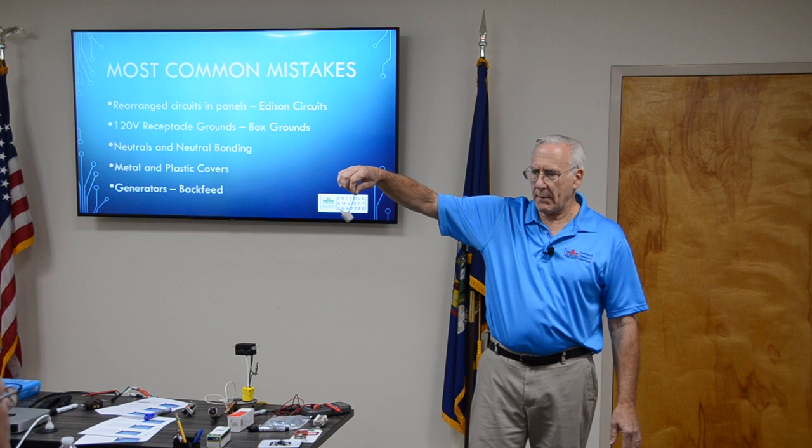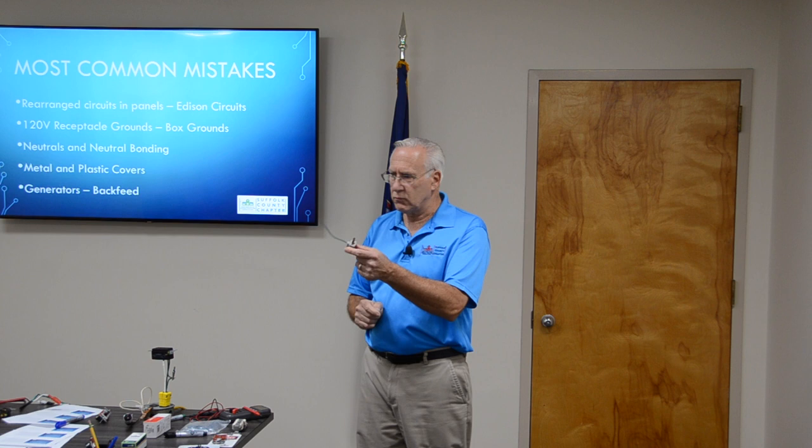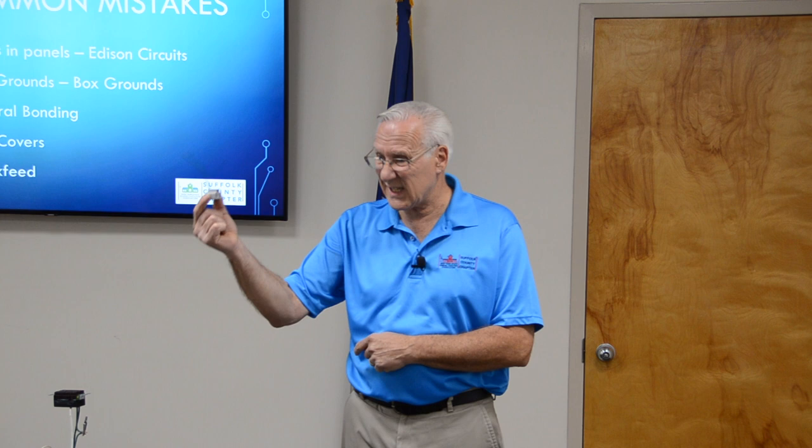Well, not too common anymore, but there used to be a lot. Do you know that you were supposed to connect the green wire to a ground? When you use these, how many times have you ever seen somebody connect that to a ground? These were always used incorrectly. They were changing the ground to an ungrounded outlet without connecting the ground wire. What good was it? Most people on the planet didn't understand how to use this, which is sold in a grocery store.